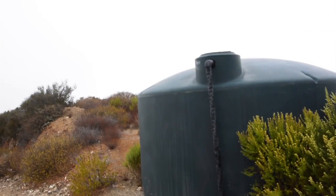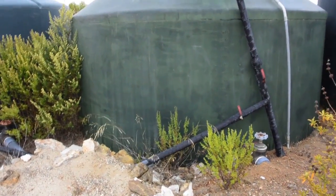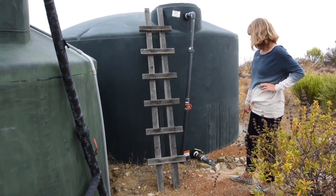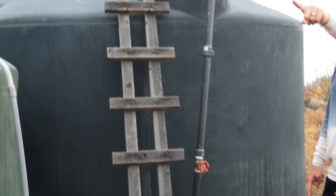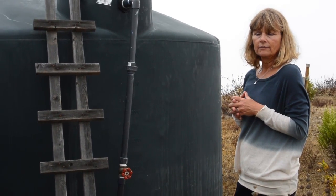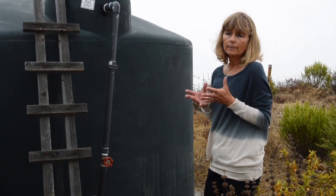Very simple. Both these two tanks have 4-inch lines, which are fire lines and feed down to a small fire hydrant that we have down below. We recently added this tank, another 5,000 gallon tank, again feeds up, and then we open this line up for usage. Currently, this tank has about 1,000 gallons in it. This one is tippy-toppy full, and this has about 1,000. So right now, we're kind of right around 6,000 to 7,000 gallons, so we should be fine through the balance of this year, and hopefully we do get rain earlier, maybe November, December this year.